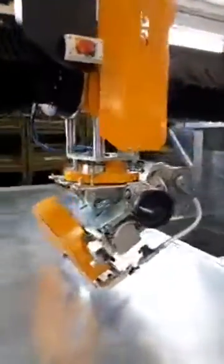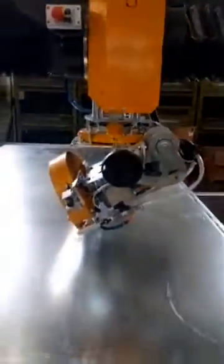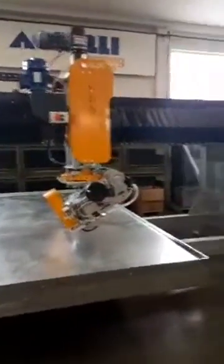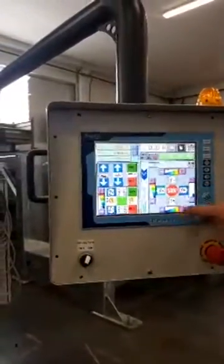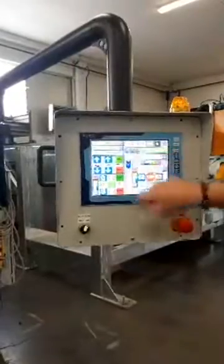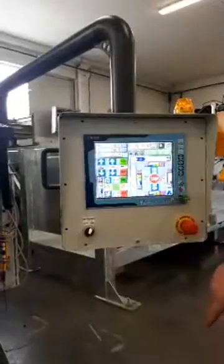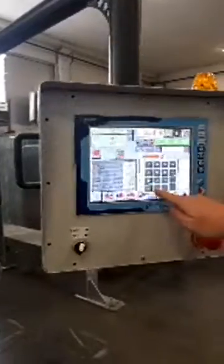Talking about machine operation, in this 3-axis model, we are describing 2 axes interpolated simultaneously. The numerical control offers three operating environments. Manual mode, where the saw works as a manual machine that does not require any programming skill, so even the most inexperienced operator can use it. The absolute and relative positions of the head along the axes are displayed in real time. In automatic mode, automatic programs can be entered to perform a series of parallel cuts at the desired length and distance from each other, and then cross them by manually turning the head of the saw.